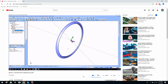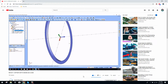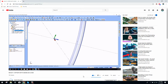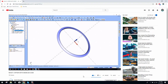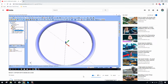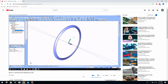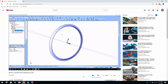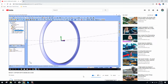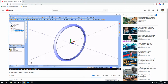We were able to do everything from this side, come in and part it most of the way off, and then break it off and just deburr that inside edge down there. But again, kind of a wild little part because it is so big and open in the middle, but really thin. So it's kind of tough to work with. So those are pretty cool parts. Kind of got to think about your approach on that, and sometimes you get into it and it doesn't go exactly how you think. So got to be able to adjust accordingly.